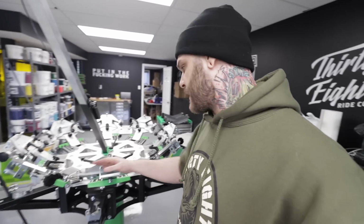Well, there's no turning back now. This is actually super straightforward and super easy until we get into the final adjustment stuff. So in order to get the side clamps on, we gotta swap out the off contact brackets. These are extended versions because the front bar for the side clamps is really long. If we were using those same exact brackets on here, from head to head, they would smash into each other. So gotta use extended ones, bring them out. And it also comes with a longer tilt adjustment rod because obviously it's coming out farther. We need that. So we'll get these brackets on, get this thing in, and then we'll be able to get the front bar on and start doing some adjustments.